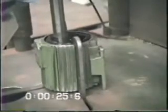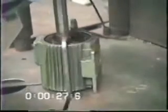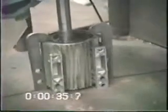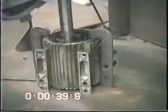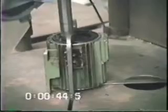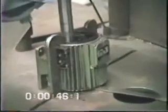With our two machines, we can strip from subfractional to several hundred horsepower stators in no time. This is in comparison to the burnout method, which not only destroys the stator, but takes many runs through just the stripping cycle alone. After our stator has been through the warming cycle, there will be no other time that the stator will have to be heated.